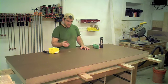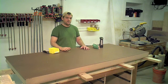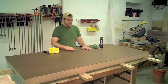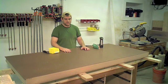So I noticed on the underside of the hardboard, as I was drilling through and countersinking the screws, I was making little divots on the underside of this hardboard. So I took a little sandpaper and just sanded out those divots where I was screwing through. Flipped the hardboard back over, reattached it with the screws, and now it's much more flat. I found about a 10/1000th of an inch dip, a little bit in the center, which is totally great. Certainly as flat as I expected, if not a lot more so.